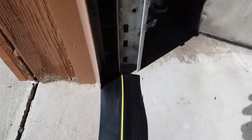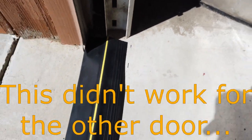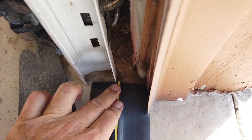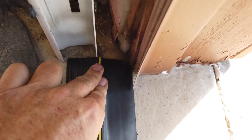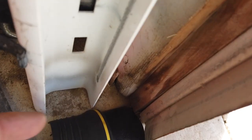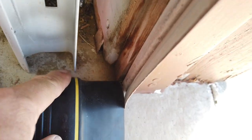They say lay the seal out and go ahead and trim it. Where I'm trimming it is right here. Basically, you line up this yellow line here with the outside edge of your track that the wheels run in, and that'll be pretty close. I'm just butting it up against it. I thought about notching this right here and putting it past all the way into the track, but it looks like I'm going to get good coverage here. I'll go ahead and build up some silicone or some kind of sealer. The wheel only comes down to right here — you can see where the wheel stops. I don't think it's going to go down far enough to hit this. Go ahead and trim it and then we'll close the garage door on it.